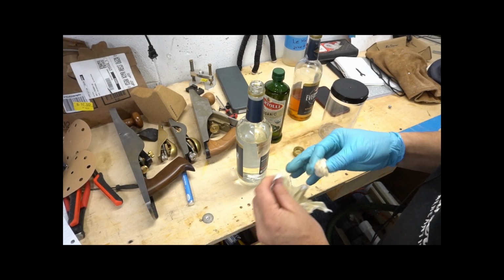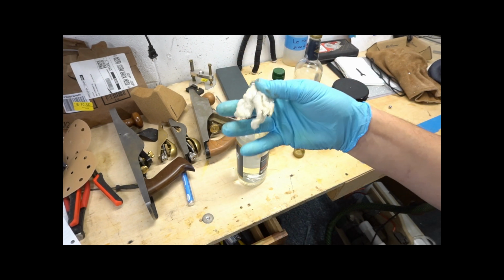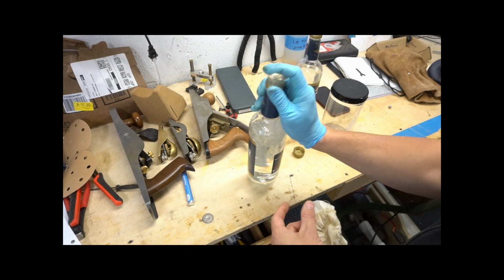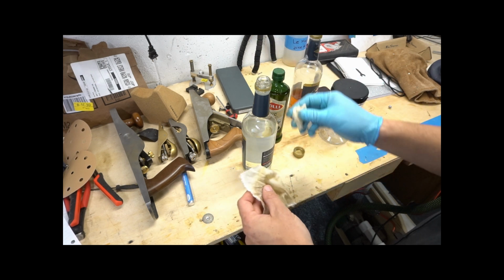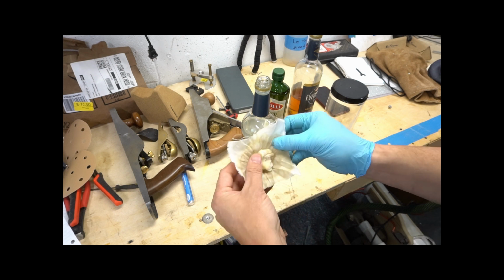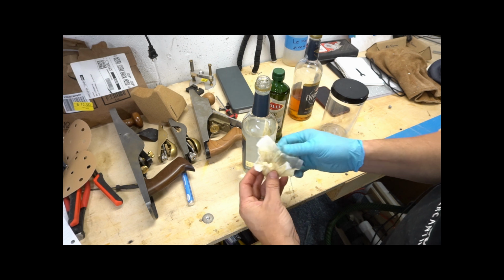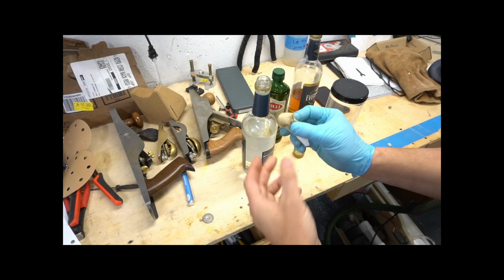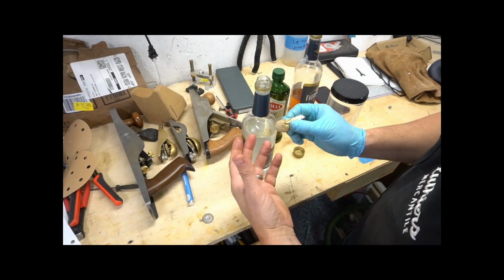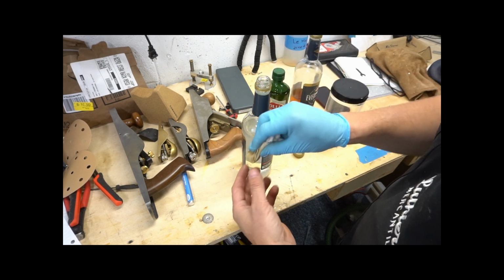We're going to do this just like we did before. We're taking our existing inner pad, charging it, but this time with the pure alcohol, putting it in our used pad. You can use a new pad, that's fine, if you really want to, but I'm okay using this one because it still has some shellac left in it that I'm planning on applying to the top.